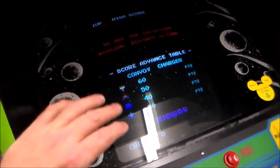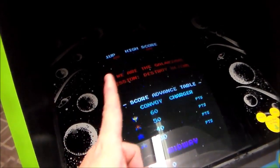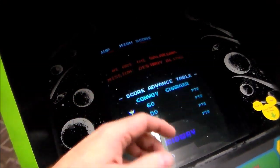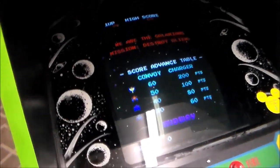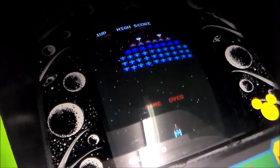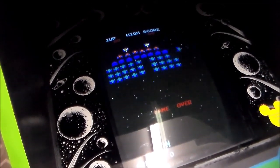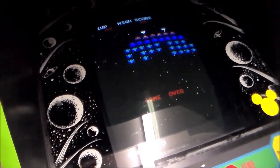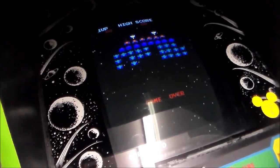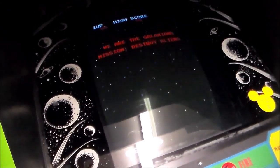And then whenever you played the game, and whenever the attract mode played, the ones in the formation all looked fine, but as soon as they took off and came at you, they turned into the ones like on the title screen where they were missing all their armor. And I tracked it down to this one little chip that was acting up. Swapped it, and here we are. It was one of the chips that feeds one of the first and second RAM. I can't remember the chip number, but anyway, just in case you were interested.